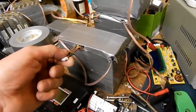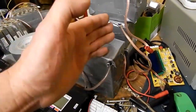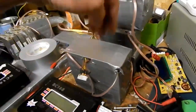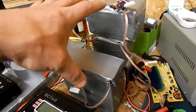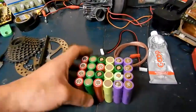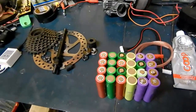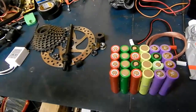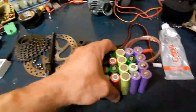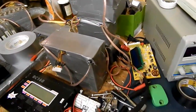This is a 24-volt pack — I can't remember how many cells per series — but they run great together. I get a full 10 amp hours out of all that. So I'd rather build cells like this than go out and buy a brand name like Golden Motor or whatever, because they get issues with BMS's and cells and everything else. This way there's no BMS — I have to do my own monitoring of the voltages.